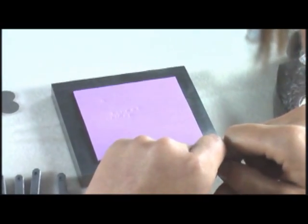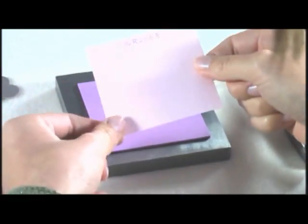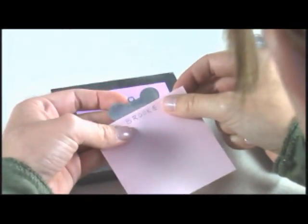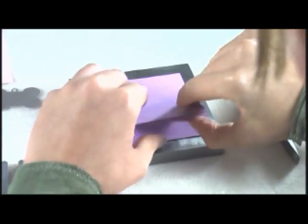If you're not comfortable free-handing it, you can mark on your tag with a felt tip marker where you plan to stamp, or you can write the name on a sticky note and lay it across your object as a guide. This helps with centering and spacing. When you're ready to stamp, lay the silver tag on the bench block with the sticky note across the surface.